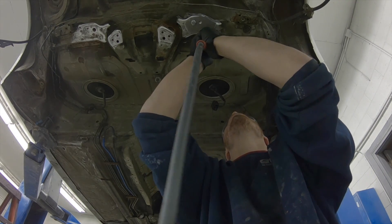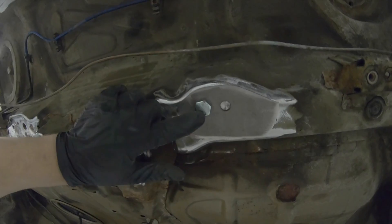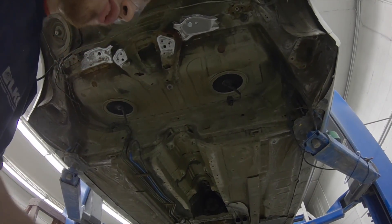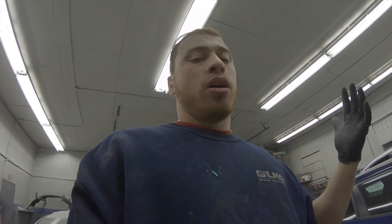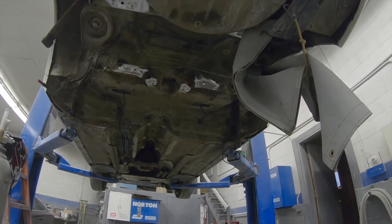Now I have the first piece ready. You're going to have the bolt caught, positioned right where you want it, run your bead all around the edge, and run your rosette weld. I have that bolt caught so it's centered, so the subframe is going to go in nice and easy. I'll include the full description for the Turner Motorsports welding plates — part number and where to get them — along with the polyurethane bushings for the subframe. I'll probably have a part four and five to get this all finished. Now I'm going to get into welding those plates.